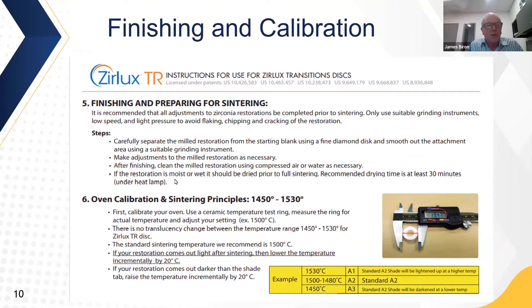With the use of white zirconia and the dipping process, it's worth considering whether you also have a purge cycle as part of your sintering process. The purge cycle typically reduces or eliminates gases from the firing chamber, which otherwise reduces the life of your heating elements.